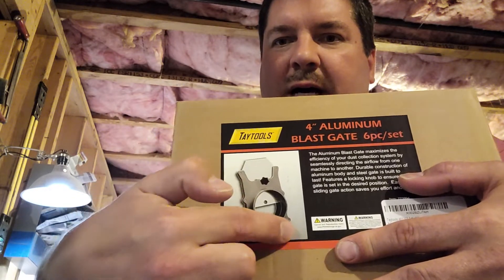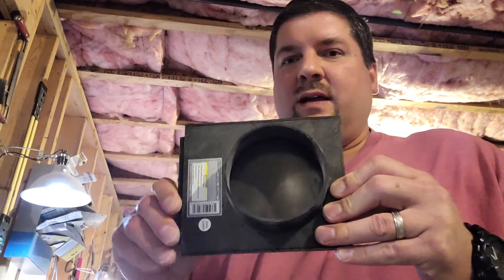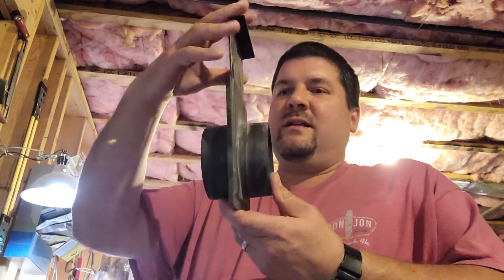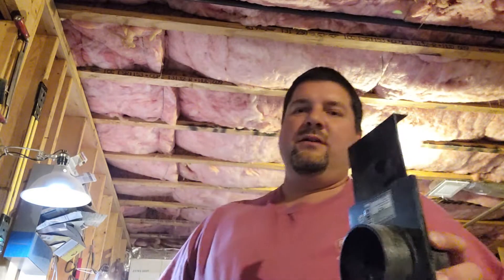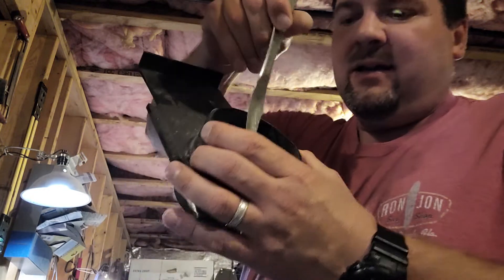Along the bottom of these metal gates is a slot hole. What that does is it lets all the dirt that collects in that little thing fall out, so it never blocks it. Another problem with the cheap gates is dust gets down in the crack and there's nowhere for it to go — neither way you orient it works well. The most heavily used cheap gates I had seemed like every two weeks I had to clean out that slot, or take the thing completely off, dump it out, clean it out and put it back on.